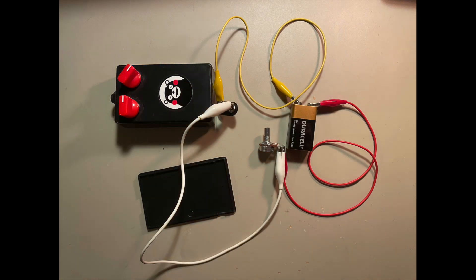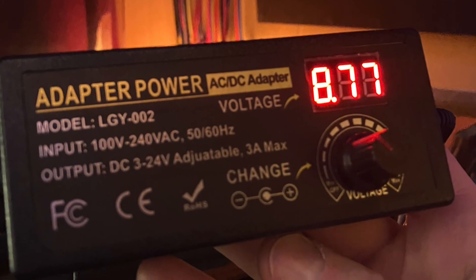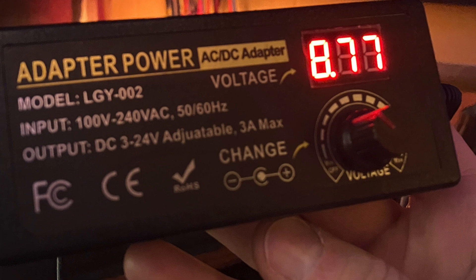For the circuit bent things, I literally took the battery pack out and put a variable resistor between the battery pack and the battery contacts inside the unit. For the DFAM, which has an external adapter and its own power supply, I found a cheap power supply with a continuously variable knob and a meter readout. I started at 12 volts, which is what the DFAM wants, and then just kept sagging it down. And there's the starve.